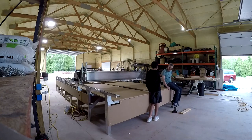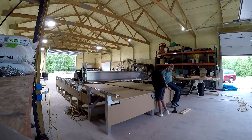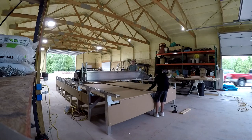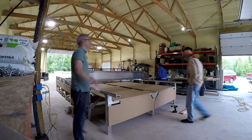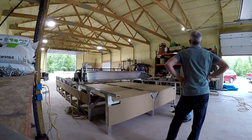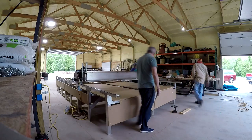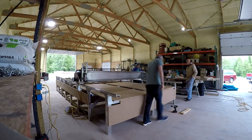I am leaving the center open to gain access to the leg levelers below, at the midpoint of each rib. The sheets on the top serve as a structure to keep the table square, and will also be used as an underlayment for the spoil board. The client typically meets us in the morning for our daily progress report, and we are discussing the gap I am preparing along the middle of the bed for access to the leg leveler screws.